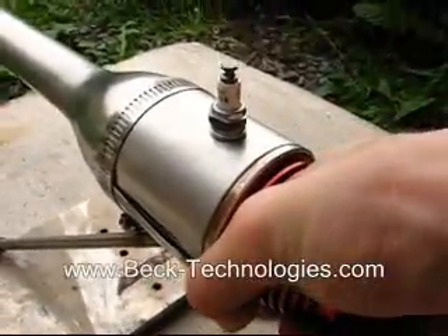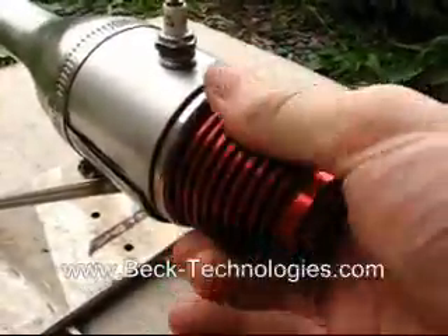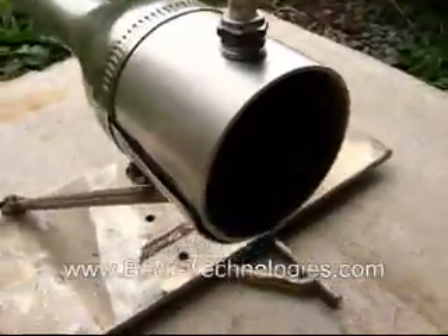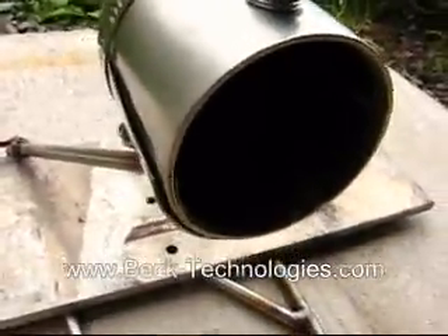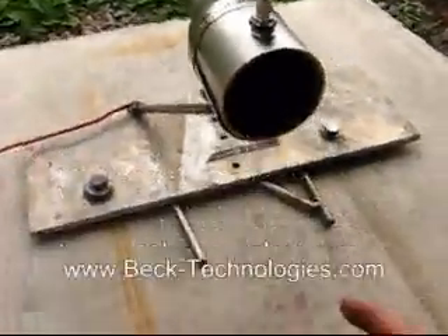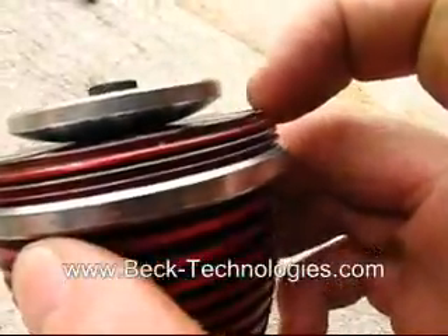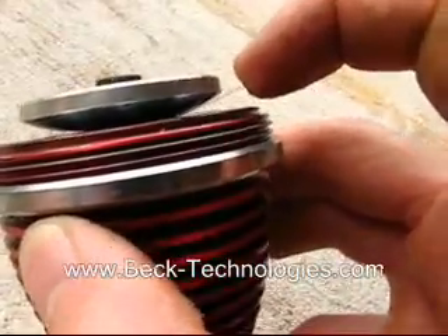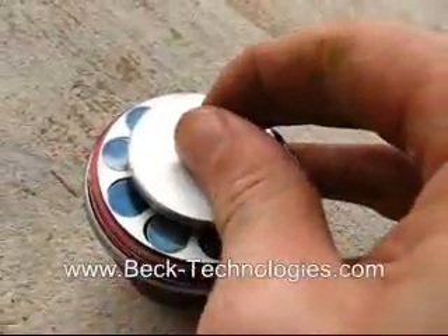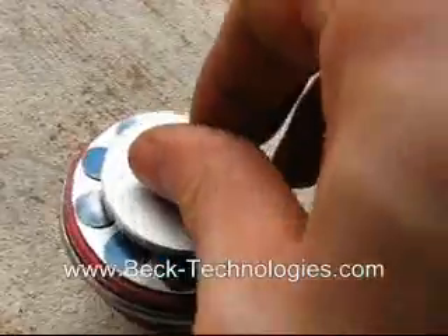I'm going to unscrew this here. The Dynajet valve head is screwed in place — it has threading on it and also a lock ring and threading on the inside of the combustion chamber. When you screw it in place you have to tighten it down really well and use the lock ring to keep it from unscrewing due to the pressure inside. The valve head itself has a valve retainer plate that keeps the valves from opening too far and also protects the valves from the heat of the combustion chamber. This also unscrews so you can take it off and replace the valves.